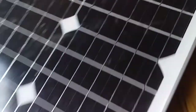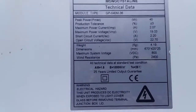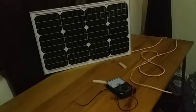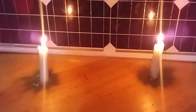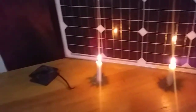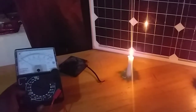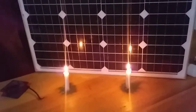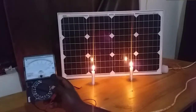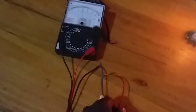This is a 40-watt solar panel producing an open circuit voltage of about 22 volts and a short circuit current of about 2.2 amperes when exposed to bright sunlight. But here we are — it's nighttime and there is no sunlight. We lit up some candles and put the solar panel as close to the candlelight as possible without damaging it from the heat. Connecting the output to a multimeter, we are getting around 10 to 12 volts with two candles.